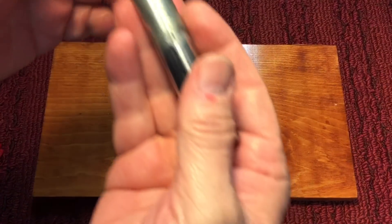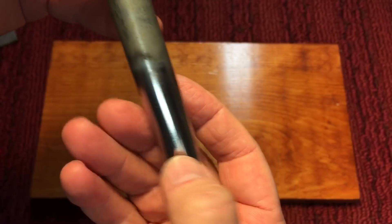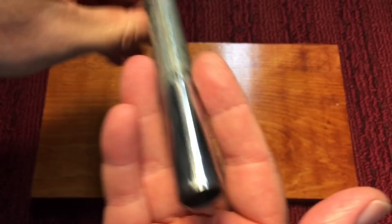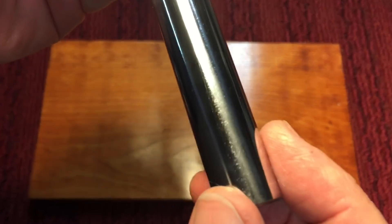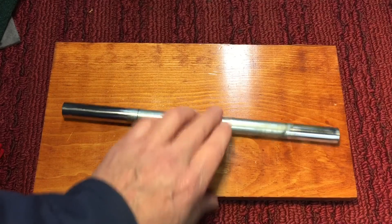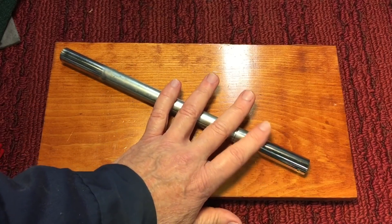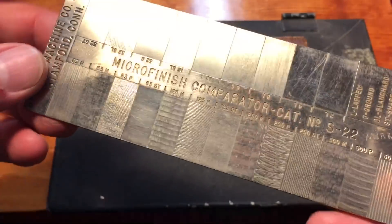Here we are right off of the buffer. First we'll look at the coarse side — remember, we didn't take it down the extra grit in the sandpaper. Still polished, still a kind of mirror finish. You can see the reflection, but look real close and you can see the striations underneath the polish. So it's a polish, but it's not. Here's where we took the extra step, and now you can see there's much more of a mirror finish. That's the difference. So if you're not getting the finish that you want, it's because you have to prep it — the more prep you do, the better the polish will come out. From a distance they both look good, but this one here is the one that will really give you a deeper, better luster on your tool. Always go with the finer finish. In closing, if you're not happy with your finish off the buffer, make sure you're taking it down to the finest finish you can get before you start buffing.